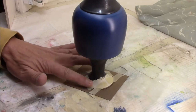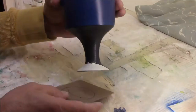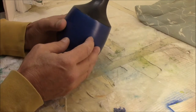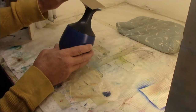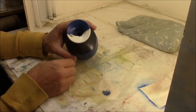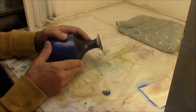Now it's the next day. This has set overnight and I'm going to take the tape off. I can see where my glue is stuck on, but all I need to do is trim that down and we'll have a nice flush, level surface. I'll grind this down and fill this in and smooth it out again — we'll probably go around a couple of times. Now we need to file down this seam where the two meet. Before it was just tacked in place, and now I've filled all that edge in and we need to file this down to meet the existing surface.